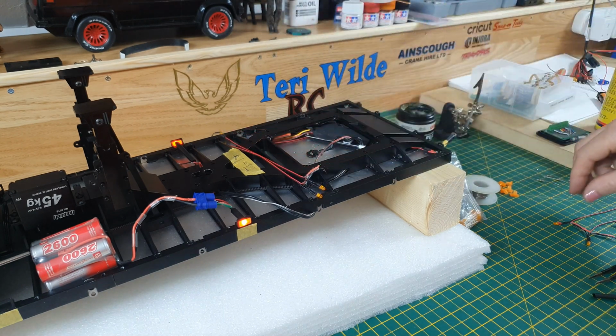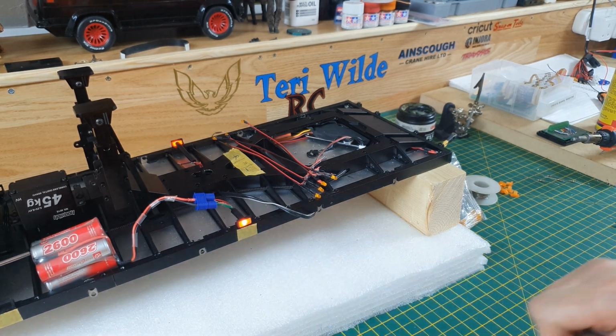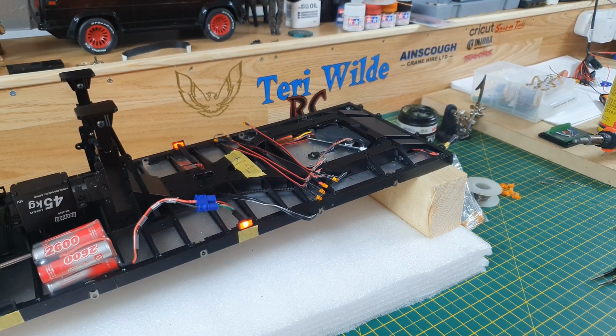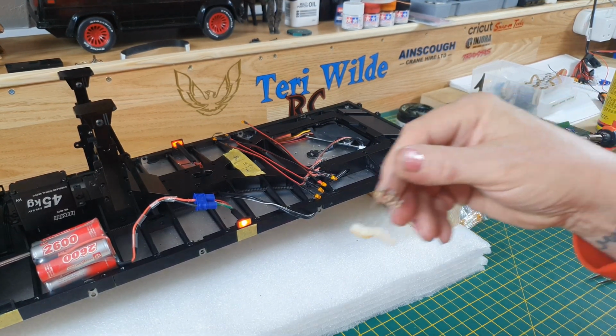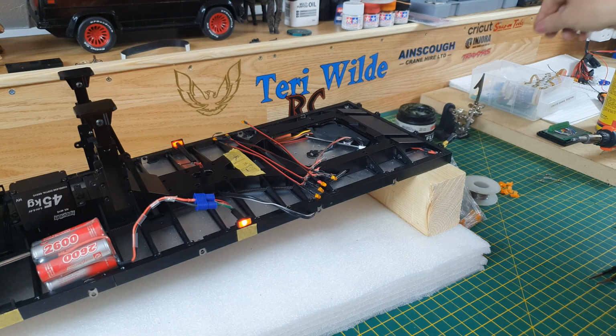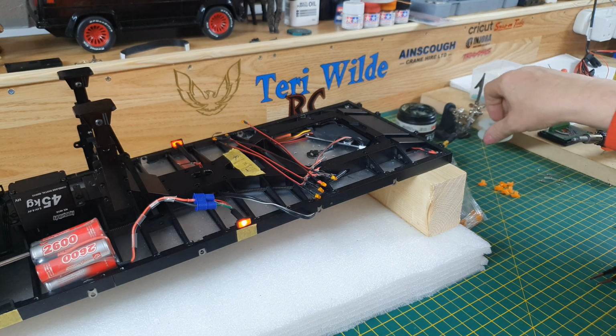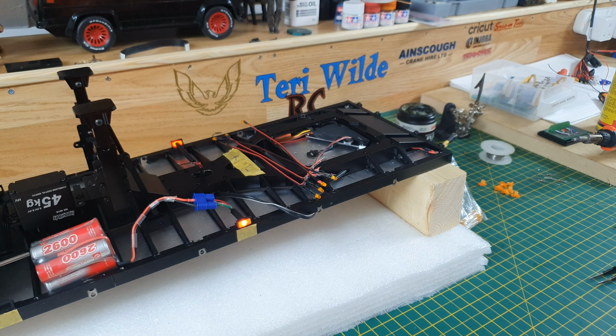the other 5 in, and bear in mind that they run off 6 volts, which I'm going to wire into 2 outputs on the MFC03. But yeah, they were way too bright, so I had to calm them down with the resistor. I'll test the value of them and let you know what it is. But the 220 K resistor, the blue ones, they were far too dim. LEDs would last longer, but you know.